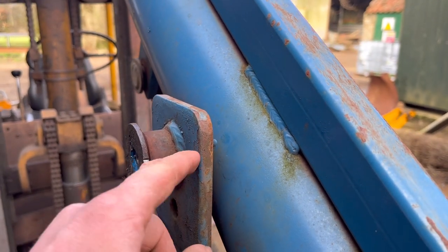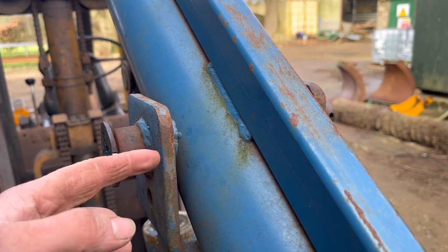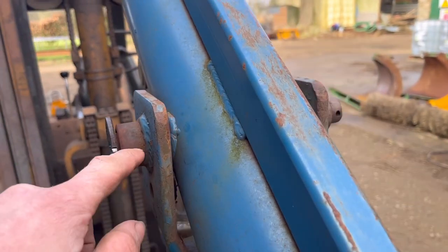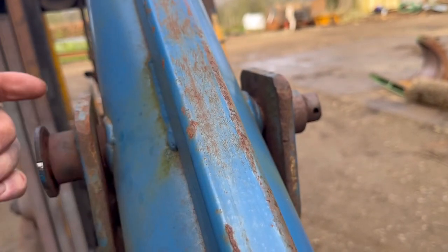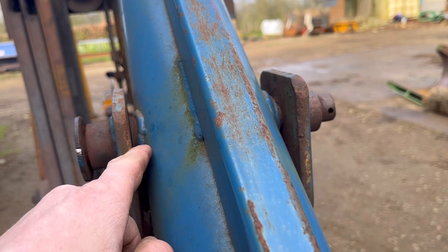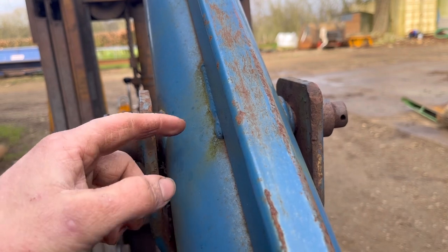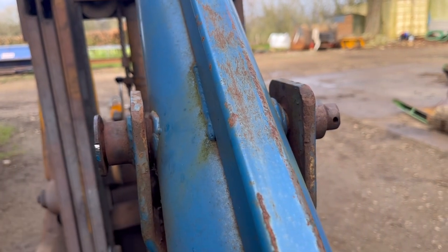The pin has a grease hole that goes all the way through to the middle, so that'll help me a bit because I haven't got so much to gouge out — just blow it all the way through. Then take as much out as you dare without melting into the outer bit, and when it cools down the pin shrinks a little bit, breaks the rust free, and then you can knock them out.